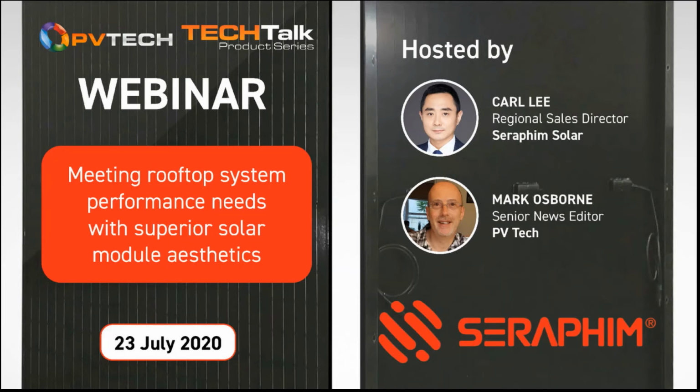Okay, fair enough. If we can just keep on that wafer size transition point for a minute, there's another good question here. Obviously we're seeing half-cut and a variety of different cell interconnect technologies becoming standard. But the question says, do these technologies combined actually reduce the need for PV optimizers or microinverters? Because obviously on residential rooftops you've got a higher potential for shading issues. And of course, with half-cut, as you mentioned in your presentation, you're limiting the power degradation because of that shading. So what's your view on this question, do you still need optimizers or can we do without them?